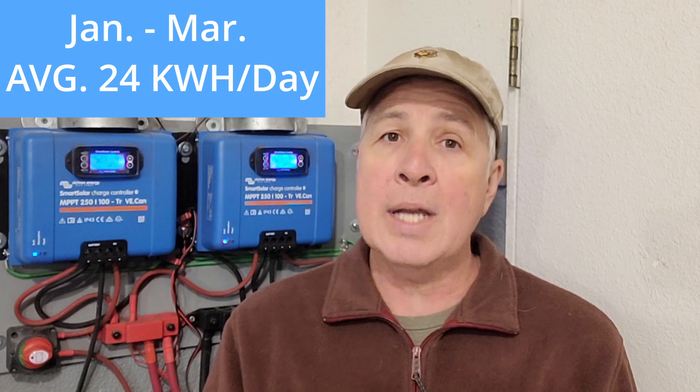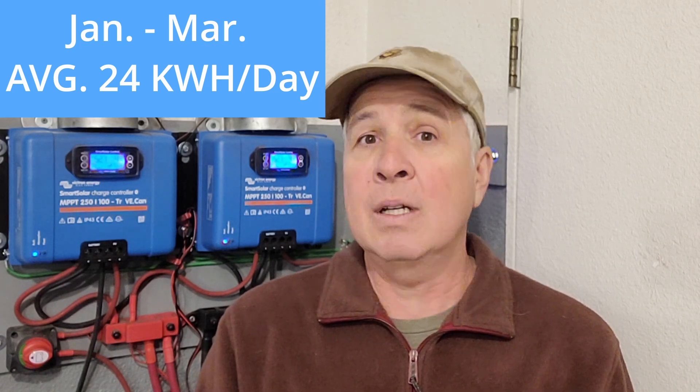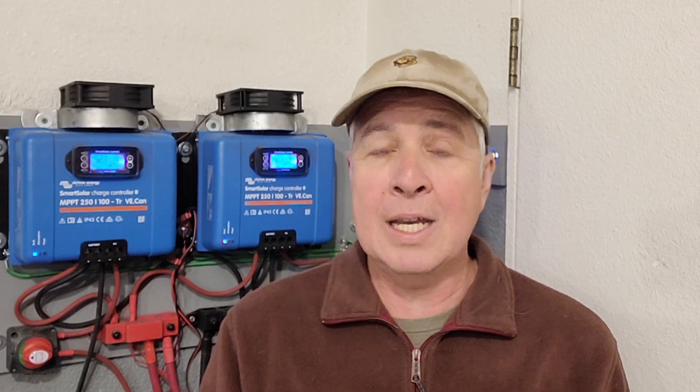Let's go inside — it's a lot warmer in here than outside, but still kind of chilly in my unheated garage. Before touching on the main issue I was mentioning, I'd like to cover a couple other things about this system. During peak sun hours last winter between January and March, I was averaging 24 kilowatt hours a day. That was enough to run 3,000 watts of space heaters for five to six hours a day and still have enough power left over to run most of my house lighting, computers, kitchen appliances, refrigerator, microwave, toaster oven, and my deep well pump.